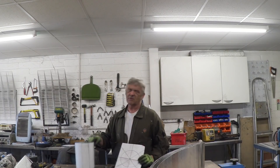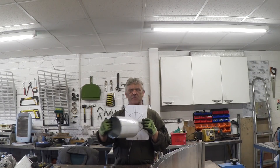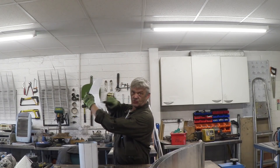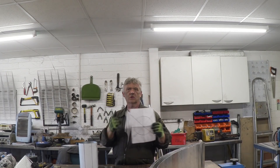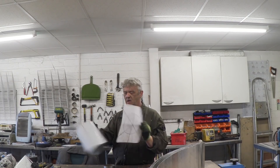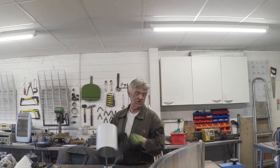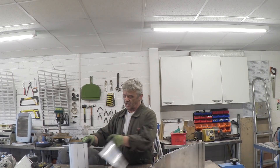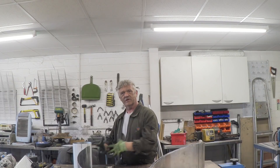Neat little trick: I don't really know where the center of the blade disc is or how big it is, so I pop on a piece of paper, draw around it, fold it over in the light so I can see through onto the circle, line them up, crease it, and do the same in the other direction to get the center. That really helps. I've done 45 degrees and I pop that there, then use a square to draw the line where the blades are going to attach. On the blades I've done a two centimeter bend — going to fold them over and then screw or pop rivet them onto the central cylinder. That's how the blades will be attached.